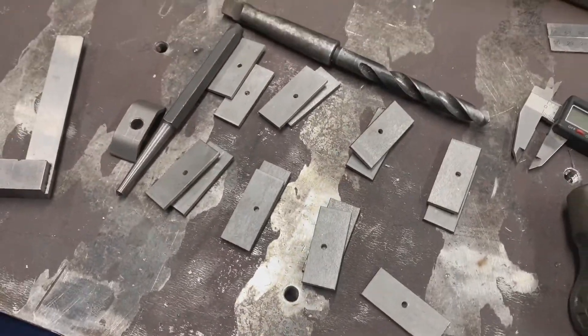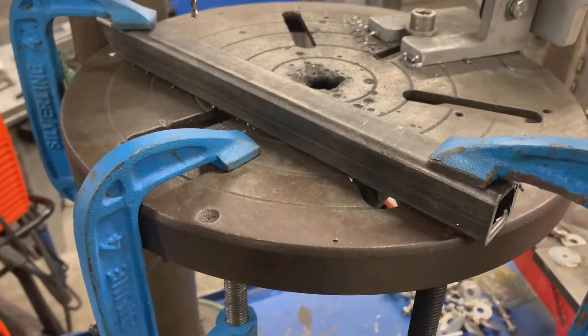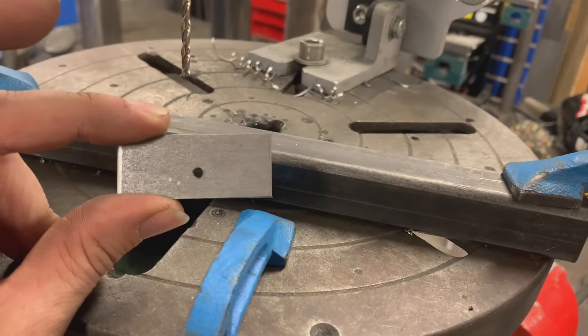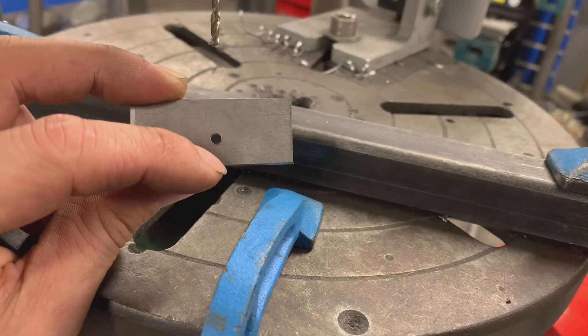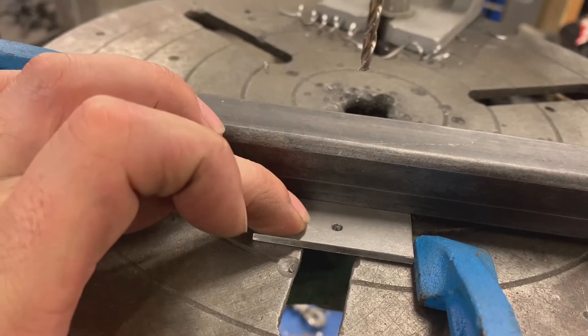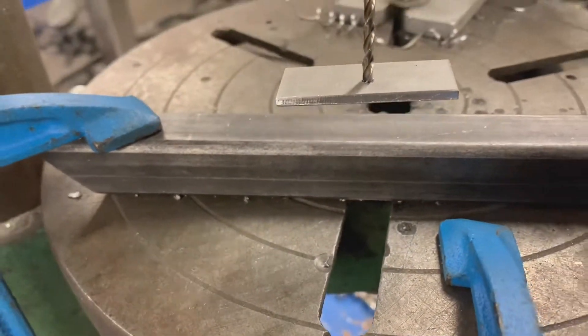While we're cutting, I'll set up a little jig and drill all of them. A little jig is just a bit of bar. For repetition, you need something to be repeatable. So the hole is in the middle width-wise but not height-wise - you're actually 8.24 mil from the bottom. That's going to be 4.2 mil underneath the 8 mil hole. That just drops in there, clamp, and drill.